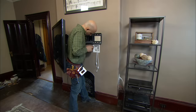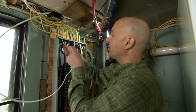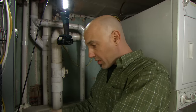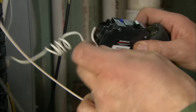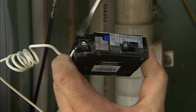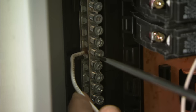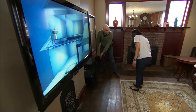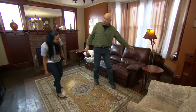I've run the wire over from the other side of the house on a dedicated circuit, bringing it right into the electrical panel. I've de-energized the whole panel by shutting off the main breaker so there's no power. I'm using an arc fault breaker, which will detect any sparks or flashes on this circuit. I attach the white and black wire directly to the circuit breaker; the white wire from the circuit breaker gets tied onto the neutral bar, and so does the ground. The power is back on, and I've put outlets everywhere you need them — behind the TV, down for the entertainment system, throughout the room, and one behind the couch for the lamp in the floor.